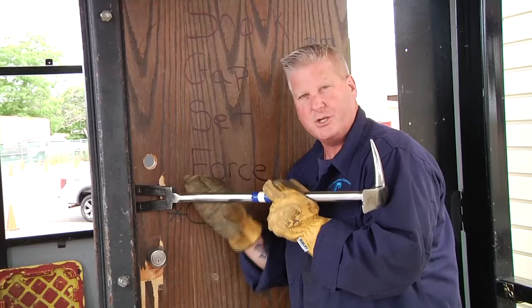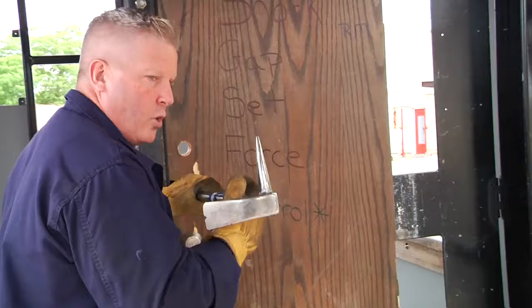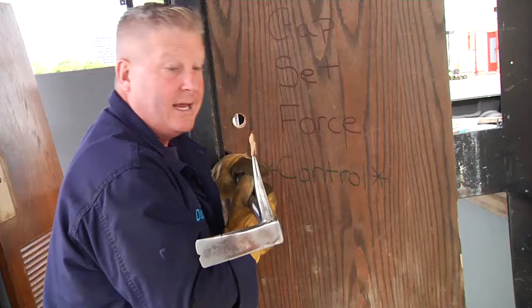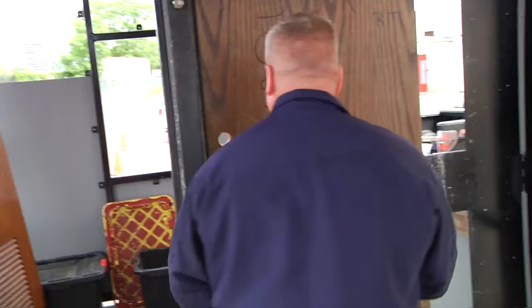If I were to stand on the outside of the tool in the setting process, right? Now, for me to monitor those forks as they come from the 45 degree angle out to 90, I have to continually lean my head into the strike zone. If the striking member misses the head of the Halligan, he's probably going to hit my head, which could be a problem. So again, just remember, shoulder to the door, bevel of the tool to the door.